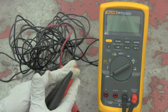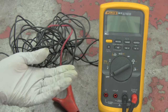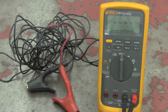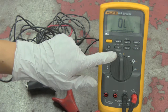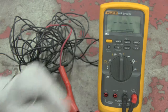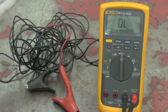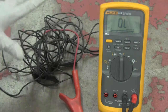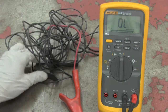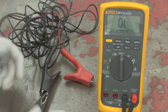This next function is really handy if you're trying to measure continuity — also known as resistance — of a long piece of wire when you're not able to visually see the meter screen. Simply turn the dial to the ohms sign; you'll notice a little sound wave sign right next to it. There's a button up top to activate the beep signal, so anytime there's continuity between whatever you're measuring, the meter will beep. We'll use a homemade 10-foot jumper wire as an example — it's always a good idea to check that your test equipment is good.